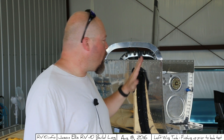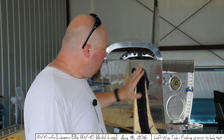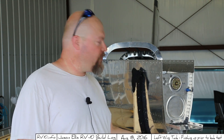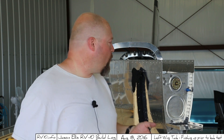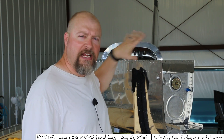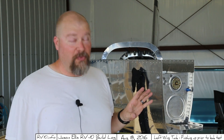It's the end of a journey. What you just watched was me going through and finishing up — adding all the ProSeal, adding all the ribs and all the rivets exterior to this tank. For the most part, I think I've done a fairly good job. It's a little goopy on the inside. I've done my best to go through and clean off the outside — a little bit of acetone or brush cleaner and any excess stuff on top comes right off. Go real lightly though. Don't pour it on — just use a little bit on a rag and let it barely wipe off. You don't want to penetrate into the interior, so keep it clean without destroying the work you've done, because having to go back and redo it would suck.